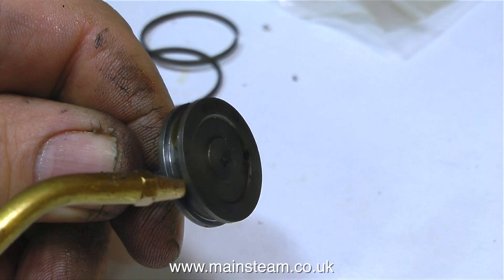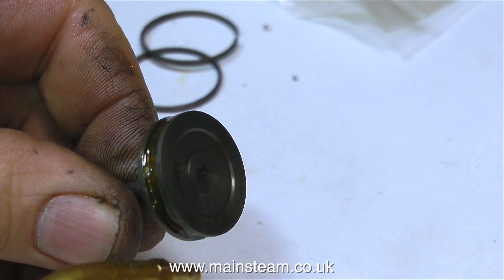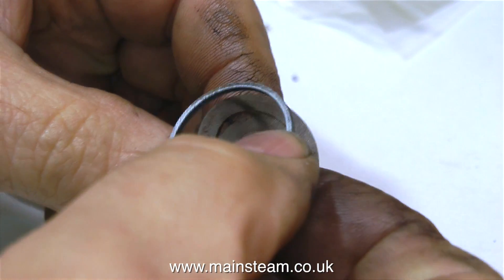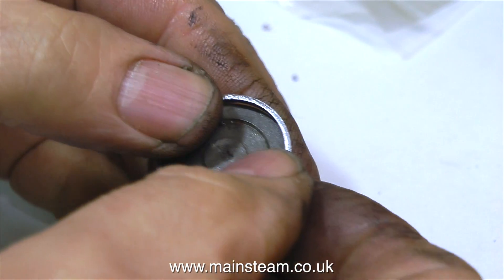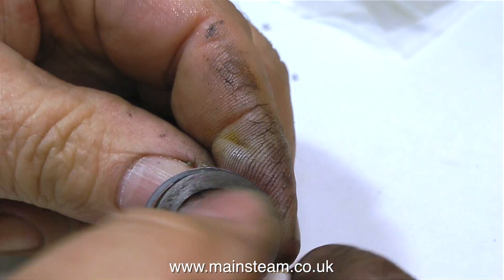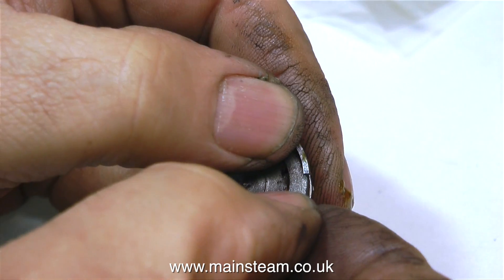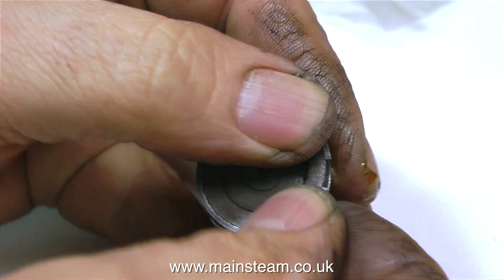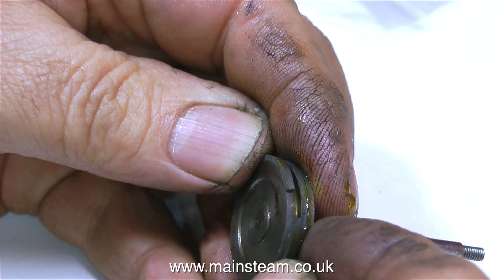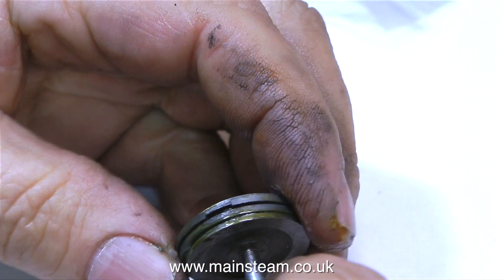They fell out of course, because they would do because I was making a video. So the next job is to lubricate the piston thoroughly with some steam oil and fit the piston rings — this is a very tedious job, or it can be if you break the piston rings. You just have to be very gentle yet firm at the same time. Cast iron has very limited bendability, if there's such a word. Some viewers may be thinking: how did he know how much to take off the piston? I could have used micrometers and tested the thickness of the piston, the thickness of the flanges, and the thickness of the two rings together, and done some mathematics — but in the end I just used witchcraft, because it's quicker and more fun.